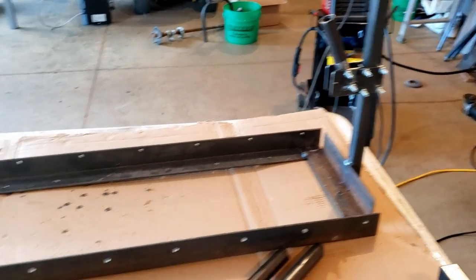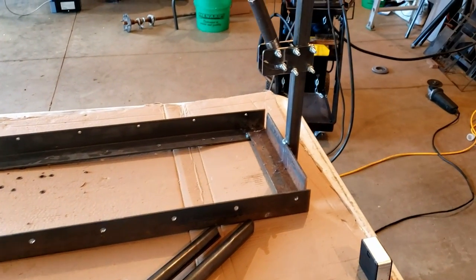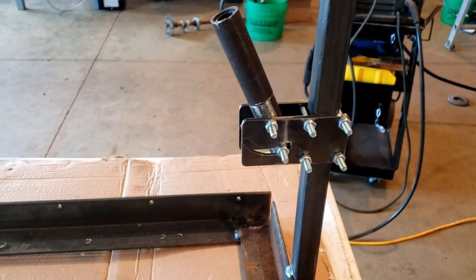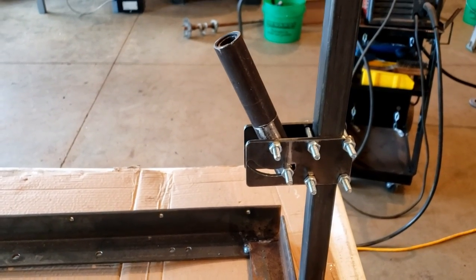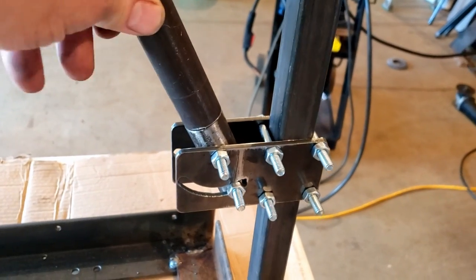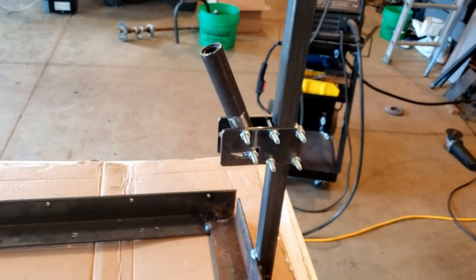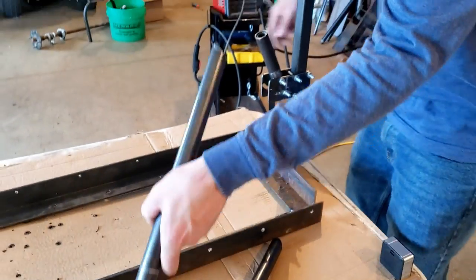So guys, we decided to make this little jig for the frame assembly. We made a little adjustment here. We plasma cut that out when we did the other pieces, we just didn't show it. We also have a little mandrel where the neck tube fits on. So we just dropped the tubes in, and Jackson's going to drop them in.